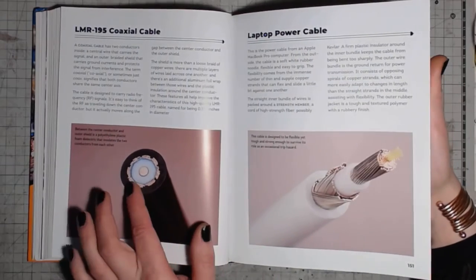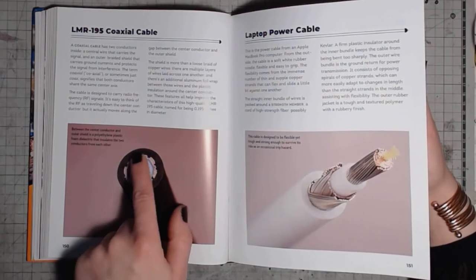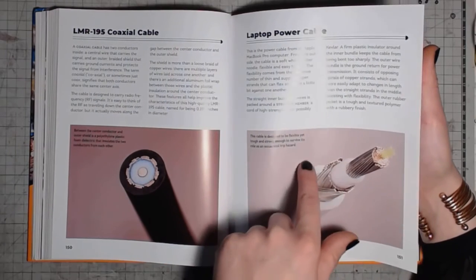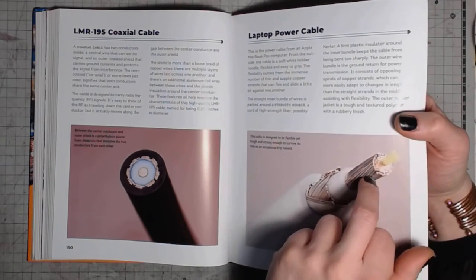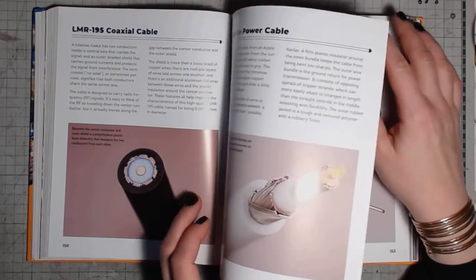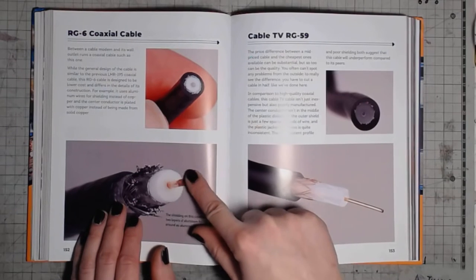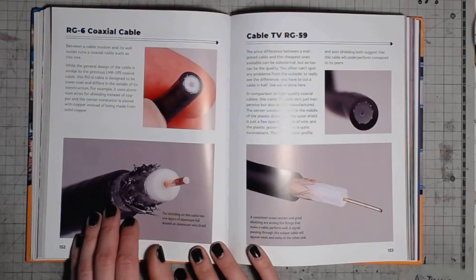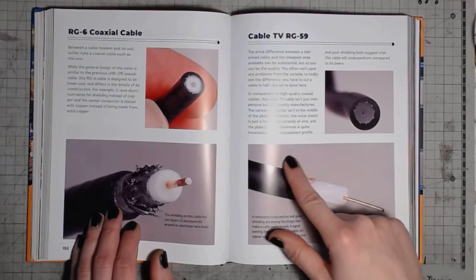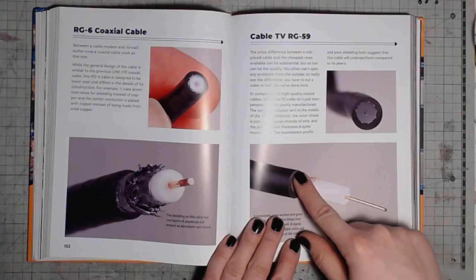Some shielded cables. This is high quality cable. This also is with some reinforcement that allows for more flexibility. This is made of copper-coated aluminum, the cheap material that makes it quite a low-grade stuff. But not as low-grade as this one, just look at the shield, look at the braid.